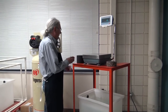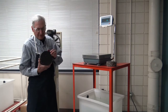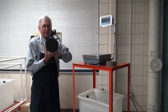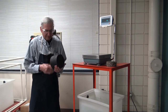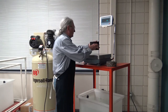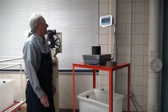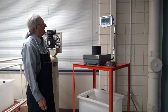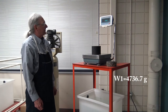I'm going to demonstrate using a gyratory specimen. When you have a gyratory specimen, the first thing we do is what's called crumbing — you simply brush off any loose material. It's not unusual for a few crumbs or particles to be stuck to it; brush those off. Make sure the scale is zeroed and get your initial weight. In the equation, this is W1. In this case, 4736.7.